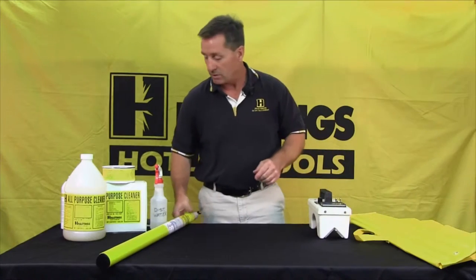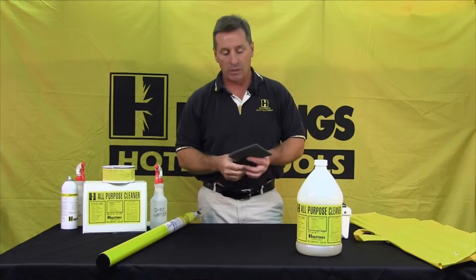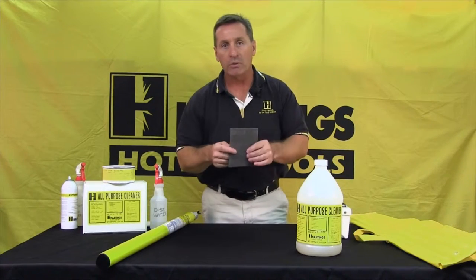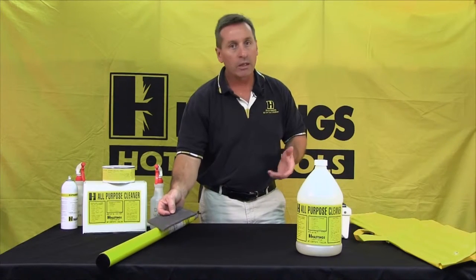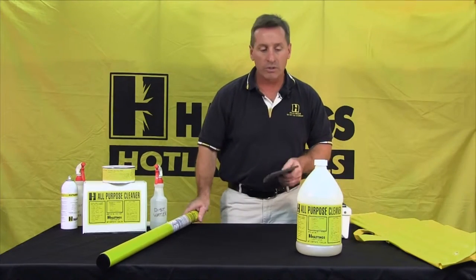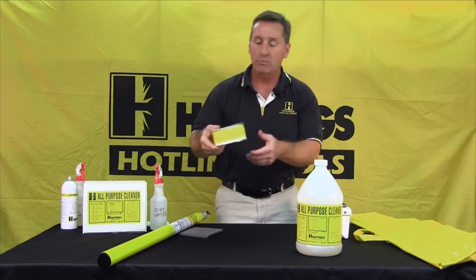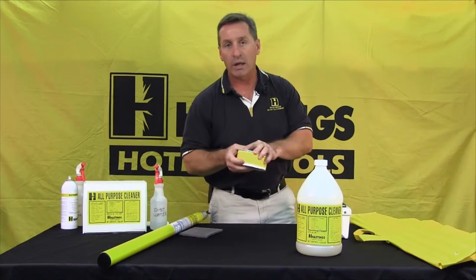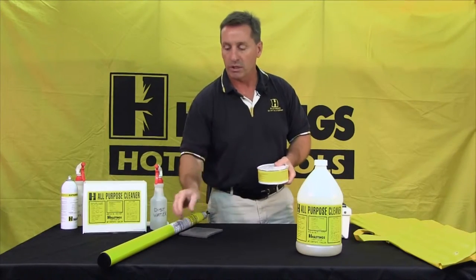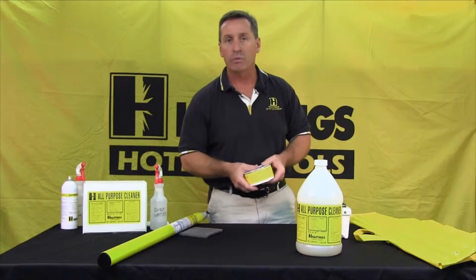For cleaning the surface, we've got the cleaner — an all-purpose, environmentally friendly cleaner — and it works well with these scrubber pads. We sell the gray color because it's non-metallic and has the right coarseness to get dirt and conductive particles out of the stick without hurting the surface. Once you've cleaned the hot sticks thoroughly with this pad, it scours off all the old silicone and wax, so you've got to put wax back on. This is our boom and bucket wax for hot sticks — a hard wax. Apply it and wipe it right off. One coat works good, two coats works better. Thoroughly cover the stick in all areas, then wipe it down. It only takes a couple minutes and the difference will show on the hot stick tester.